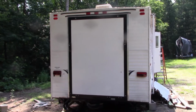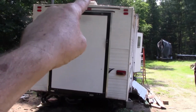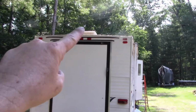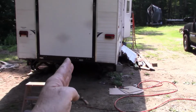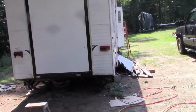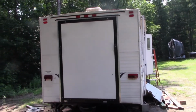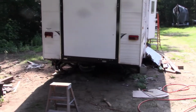Alright folks, the exterior of the camper conversion is done. So I've got the aluminum trim around the outside that the gasket on the door seals against. I put the gasket on the door, I got some rain gutter across the top of the trim, and overall reinforced where the rear bumper was cut off to prevent the deflection of the I-beam, and everything is weathered in. So I've got silicone around all the light fixtures. I've changed all of the lights to LED bulbs or fixtures. Let's see. So the hot water heater is reinstalled.